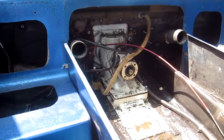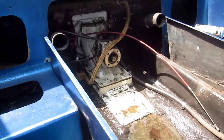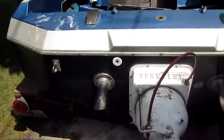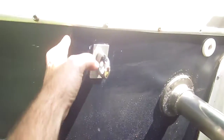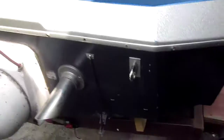Just so anyone has some curiosity — the transom on this boat is right here, flat all the way across. On the inside it starts just on the outside of these tow hooks. We're going to chop out all the wood on the inside, clean everything in here, and then tab it all with fiberglass over there.